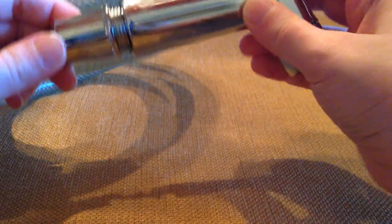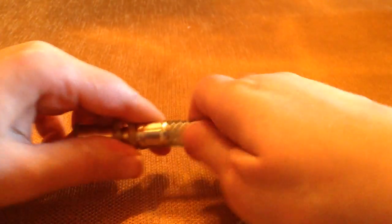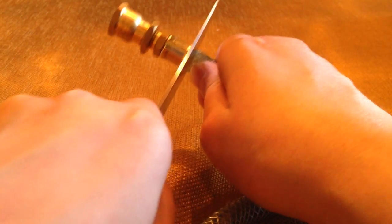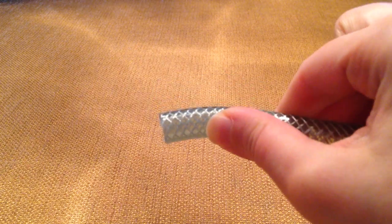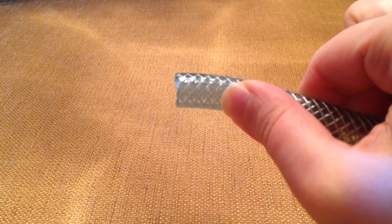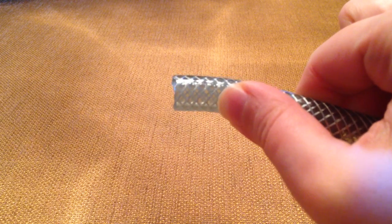The first thing you're going to do is open your kitchen sprayer and connect the head — just screw it on pretty tight. Then you'll take this end of the hose and cut it off, getting as far down as you can. Here's what the end looks like when I've cut it off — it's not perfect, but you want to try to get it as straight as you can. You can go back over it with a box cutter to even it off if you need to.